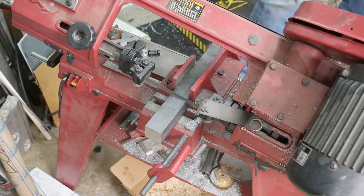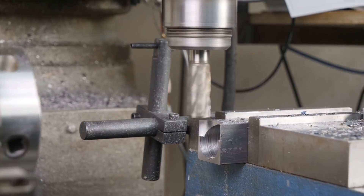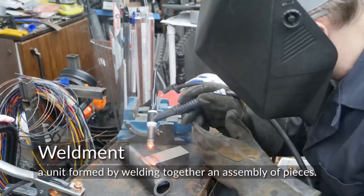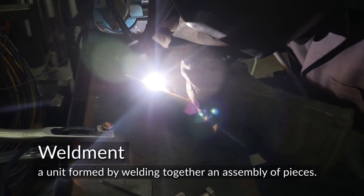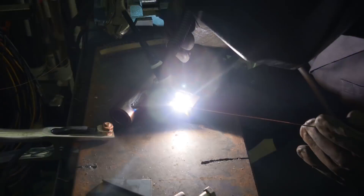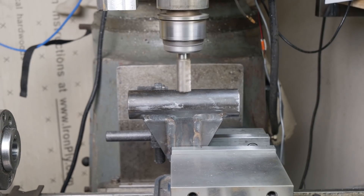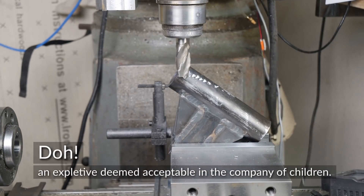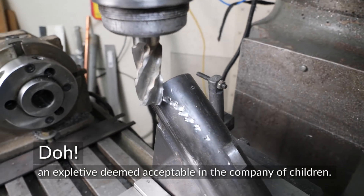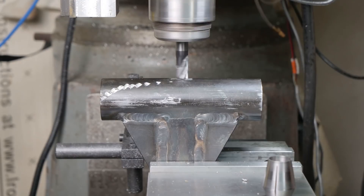To make sure it's strong enough, we're using heavy steel bar stock, machining the basic shapes we need, then assembling them into what's called a weldment. It's not super precise but that's okay because we're going to true it up in the mill afterwards. But always securely hold the workpiece — or you might do something like this. That was an expensive tool and now it's garbage!